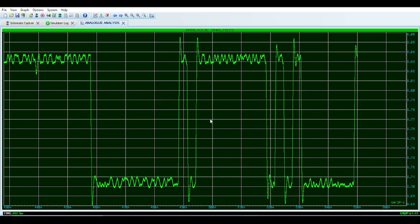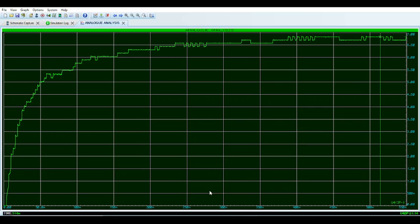There's a lot to improve on with this particular way of doing things, but this way does function, and gets to the set point. It oscillates quite a bit, but does get there. And the way it goes up and down is sort of normal, because it's coming from a solar panel, not like a wall socket with stable power. Remember, the charge controller is constantly trying to find the charge, and the input voltage is constantly changing. So that's why it looks like this.